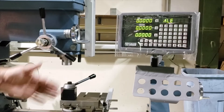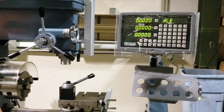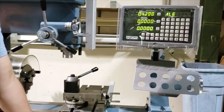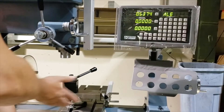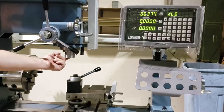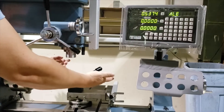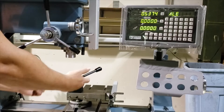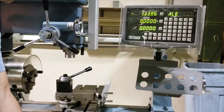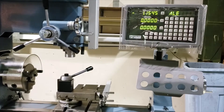One of the things that's going to pop up is your directions and inversing them. If you look at this machine — if we move our carriage to the right in a positive X fashion on a coordinate system, we're moving this way, which is technically correct and should be a positive number. But if you think about it in relationship to where your tool tip is, your tool is actually moving to the left on the part. Your table's moving away, your tool's stationary, so we're on the negative side. So really this axis is backwards — this direction should show positive numbers, this direction should show negative numbers.